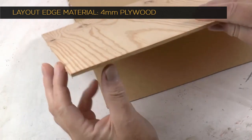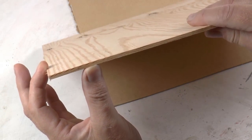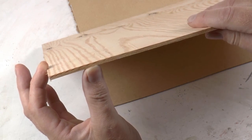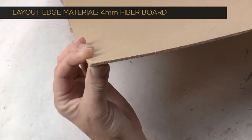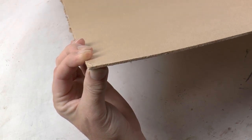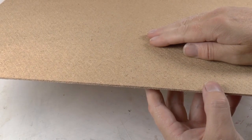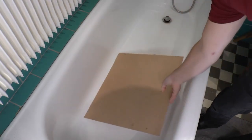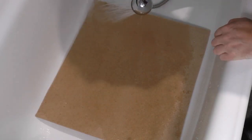As said, I used plywood. This is 4mm thick, which is a bit more than 1/8 inch. It's the more elegant material, but also a bit more pricey and hard to work with compared to these boards. They're really cheap and easy to make curved around the edges and things like that. These ones are typically just painted and assembled with the textured side inwards. I personally think that curved edges look better than joints with sharp edges.